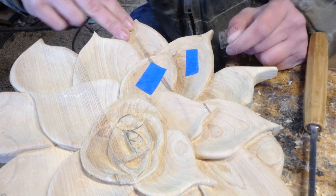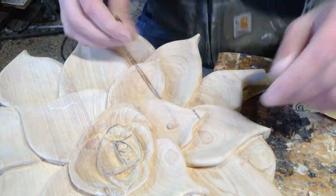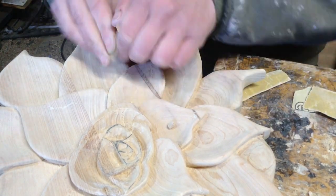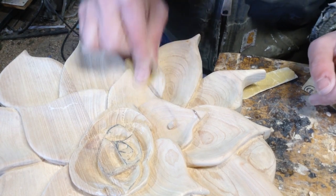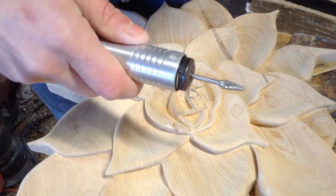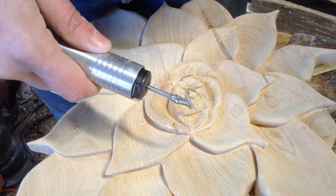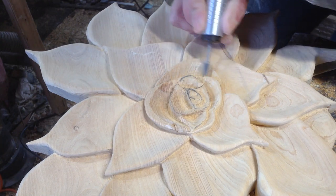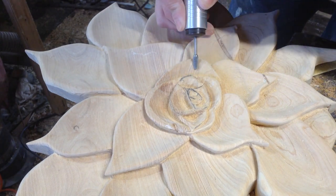In order to finish these up I'm hand sanding a lot. The Dremel smoothed a lot of this out, but I went through with the chisel just to remove some of the high spots and ridges, which you will get from Dremel work. Most of the final sanding I'm doing with 120 grit sandpaper by hand - doing it by hand you can kind of fit all those contours. That's how I finished all the outer leaves.